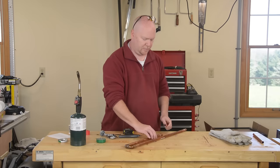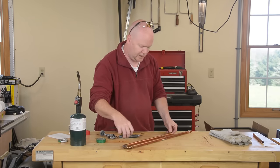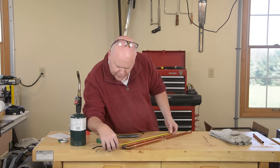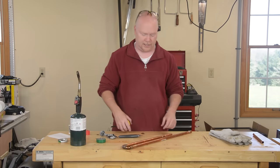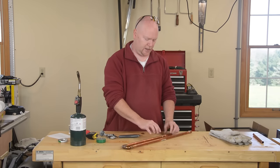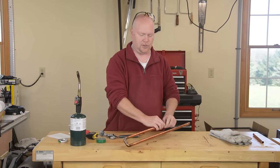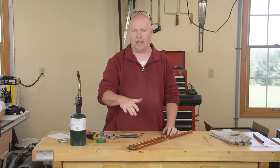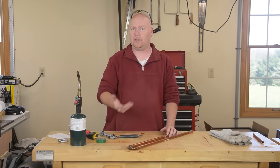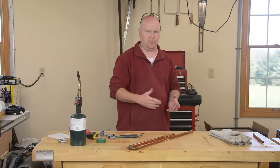Here's the rest of my quarter wave matching stub. If I slide that in there and bottom it out, I should have 49.1 centimeters on this leg. I'll be able to make this leg a little bit longer by sliding this thing out if I need to. That will tune the antenna down lower, which in this case is probably the direction I want to go, as the simplex frequencies are all at the bottom of the two meter band.